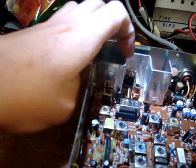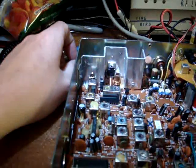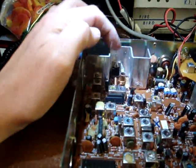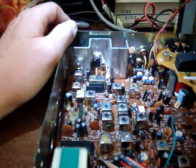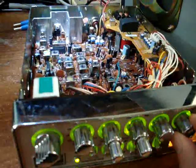Your adjustment points are here and here, and then you can do some spring spreading back here, but you're not going to get a whole lot more wattage out of it either way. The ERF 2030 is a 25 watt part — you can read the spec sheets on it all day long, that's all you're going to get out of it. I'll show you what this radio does on the meter — we're on the Super Bowl, channel 6.